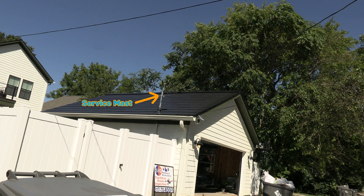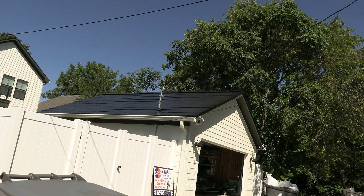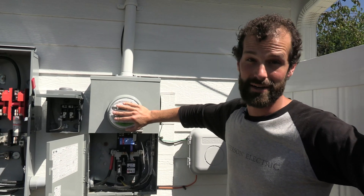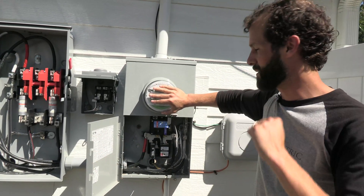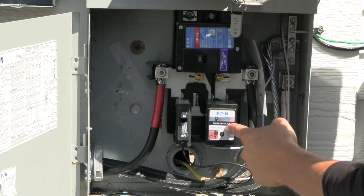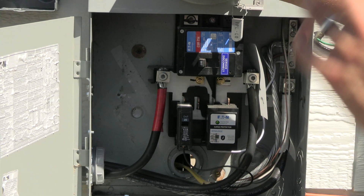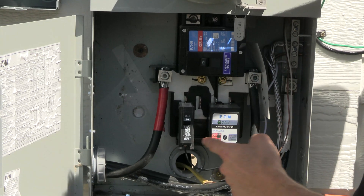And drop into our customer's garage — cue the roof. There it is. It looks great. Here's our customer's 200 amp bi-directional meter, which is required for photovoltaic net metering. We've got a 200 amp service disconnect. Surge suppression — you always want the surge suppressor to be located as close as possible to the incoming utility power, so we've put it right there.